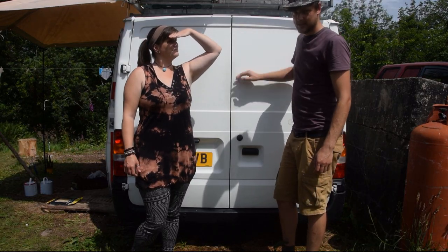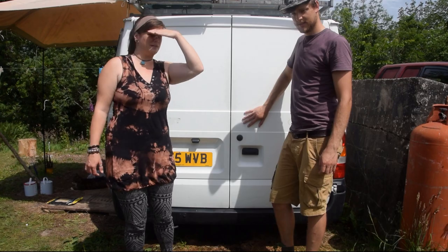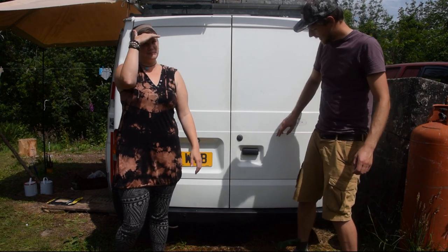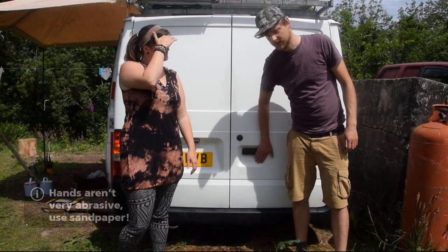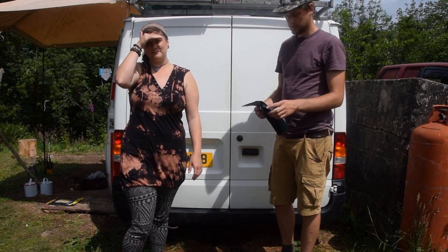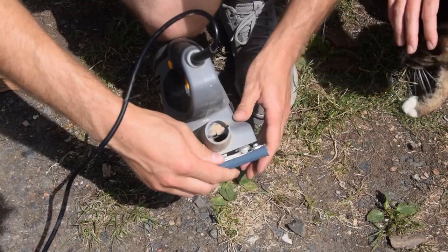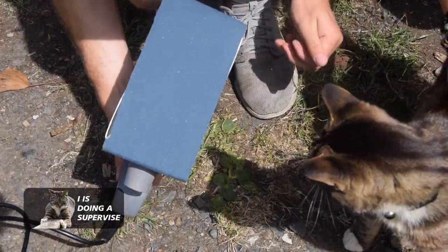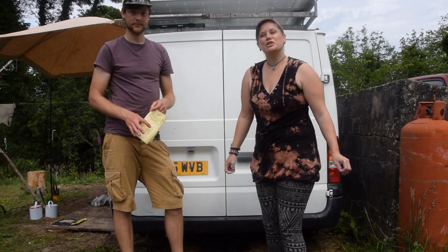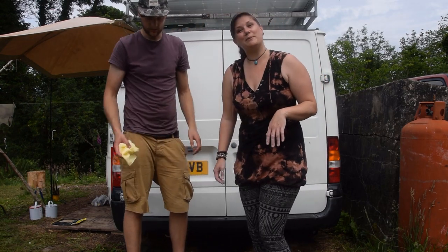It's a really hot day today so it's dry already after only five minutes. The next step is to sand it — not really looking forward to it because it's white and a bit bright. We're going to take the power sander to the big flat surfaces and then go around the nooks and crannies by hand. We're going to be using 320 grit to get a nice key so that the paint grips. It shouldn't take too long because it's mostly flat panels. Now we're just going to wipe it clean to make sure we've got all the dust off before we start painting.